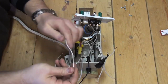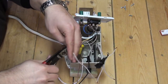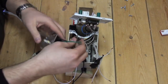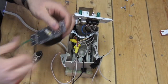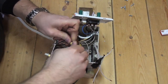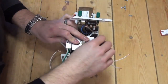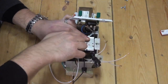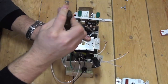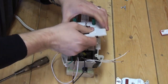Start by taking the positive connection wire that is marked and spliced to the transformer positive lead. Trim the excess and strip appropriately. Then take one positive lead from the dimmer switch and attach it to the transformer connection wire. Then bury the spliced wires into the electrical box. Then attach the dimmer switch to the electrical box, making sure to keep the remaining positive lead and ground wire towards the fuse box and 14-2 service wire. Attach the faceplate and make sure the dimmer switch will line up properly.